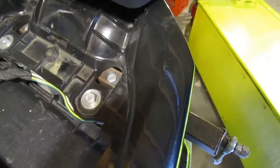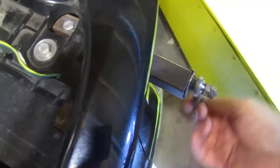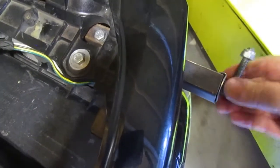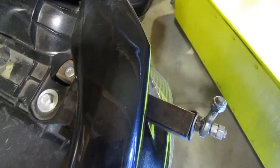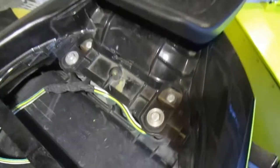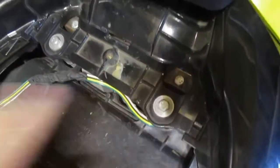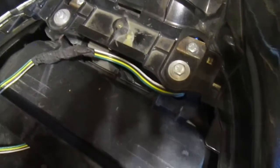Okay, I'm going to go handheld on you here for a few moments. This is the connection to the scooter itself, and each side again has a ball joint. This lets the trailer go up and down as we go down the road over bumps and whatnot. This is just a simple piece of square inch tubing with holes in it to bolt to the frame of the scooter itself. I was very lucky that the scooter had those. That made making this hitch and connection really easy, and being part of the frame, it's stiff, which contributes to the torsional stability of the whole structure.